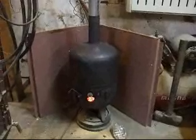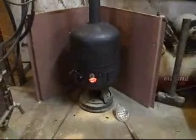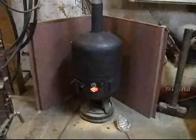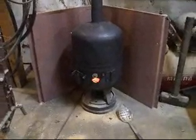If I had it to do over again, I'd make the flue pipe larger diameter. It's one and seven-eighths outside, which makes it about one and three-quarters inside, and it's really not big enough — when you open the door of the stove, some of the smoke wants to come out the door, which is a little annoying. But when the door is shut, it does fine; there's no smoke coming into the room. It definitely needs to be larger diameter if it's to be done again. But overall I like it — it does a good job of heating the garage.